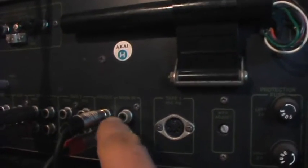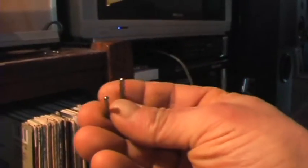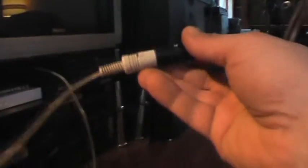But the main point today is, this is what you need to do this. This amplifier, it's an old Akai amp, and importantly, it's got a pre and a main. So you've got your preamp and your main amplifier, which normally you bridge with this piece of metal, literally making a connection. So I figured out that if I took it out and just fed the sound from the preamp, with the record player going in, an old cable from this Lenco, I've got it going to RCAs like that with this connector. It goes in the normal phono slot.